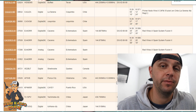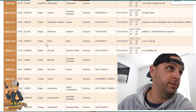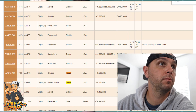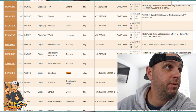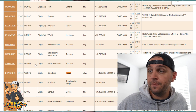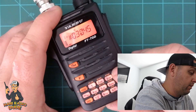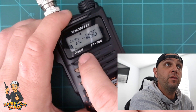If you scroll over to EN you can actually enter a node ID manually. Here we are on Yaesu's Fusion website — it has a list of nodes and repeaters capable of WIRES-X. I was going to use America Link but it's so busy that every time I try I get a busy error. Let's see if there's an Illinois link. There is a Chicago Illinois node — a repeater with number 30453. Let's switch over to EN and type in 3-0-4-5-3, then tap the AMS button. It's going to try to connect to that repeater — and it did.